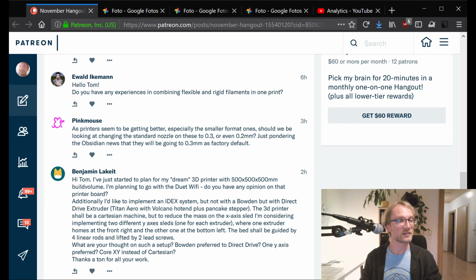So fun historic fact, back in the days, how long ago was it? 5-6 years? Pre-E3D, E3D basically standardized the 0.4 millimeter nozzle as your default. But before that, you had two sizes. You had 0.5 and you had 0.35. 0.5 being the coarser version and 0.35 being the finer version. And it was always a bit out of balance. The 0.5 one was a bit too coarse to be usable for everything, and the 0.35 was really good at reproducing details, but it was really slow to print. And eventually, people settled on 0.4 as a good compromise.